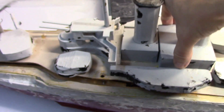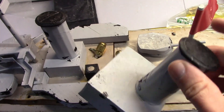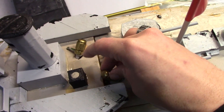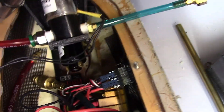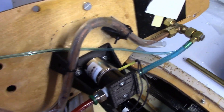One feature that's kind of cool in this boat is the gun magazines — I have them all routed to a center location under one of the stacks. This is nice because I use this boat for campaigns where you're reloading mid-battle, so it's good to have easy access to the fill tubes. That also allows leaving the aft deck in place when reloading. In the forward section you can see the gun, and I do have an under-deck solenoid mount. I wanted to use the bigger tubing — eighth-inch internal diameter — but I had to snake the magazine around because it's a 75-round magazine and I had to make sure it ended by the end of the deck piece.